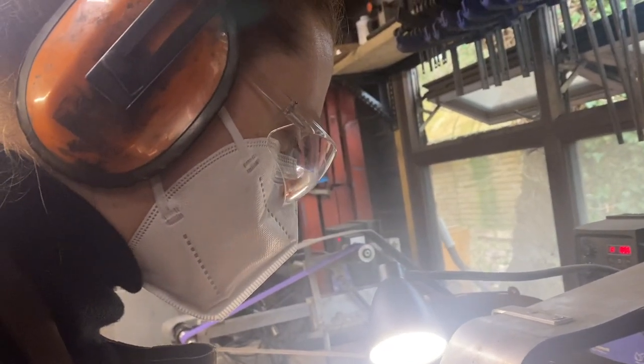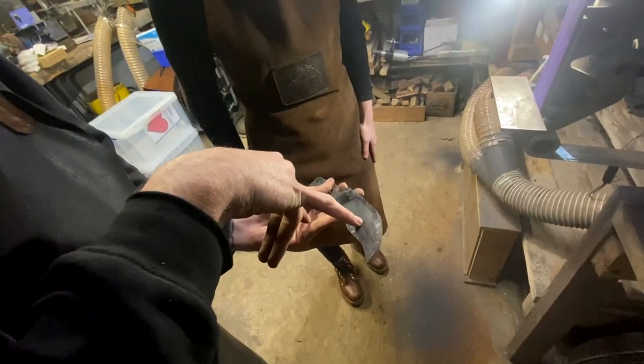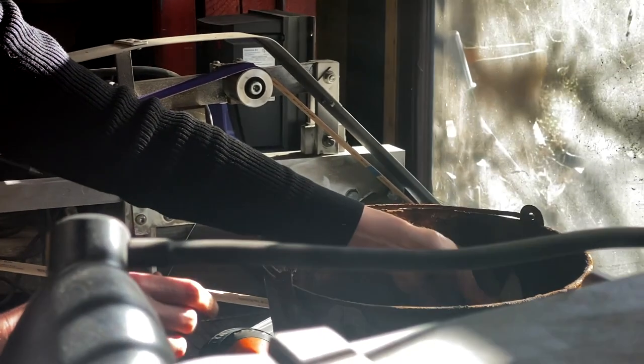Most use of grinders looks pretty much the same — you gently press the bit you want to make smooth and shiny against the rapidly rotating belt, and if it's metal you get dramatic sparks. Those sparks look extra swish if you turn off the lights. The crescents are hammer marks — where you've knocked the metal flat — so you try and make the surface smooth and shiny and get rid of things like hammer marks. The grinding process makes your knife blank very hot, so you have a bucket of water next to it to cool it down. Otherwise it would start burning your hands — I burnt my hands twice. The sparks were a bit ow, so I got some latex gloves on.